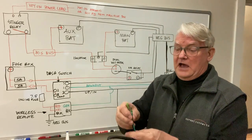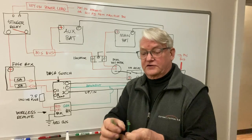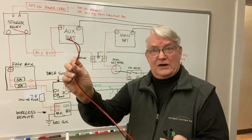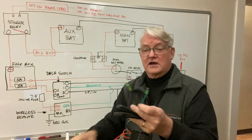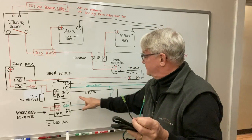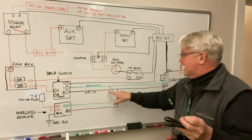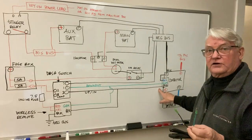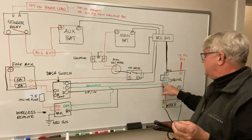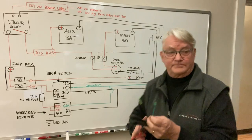There are two additional leads that come out of this harness: a green and a black. This black is not to be confused with the power negative — this is the switch black and the switch green. The switch black is the up and in, and it's going to be connected to the contactor on the black side. The green is the down and out, and it's going to be connected to the green of the contactor.